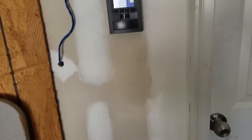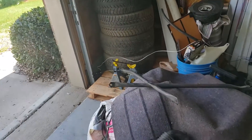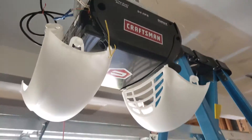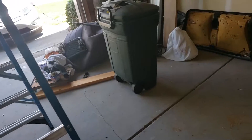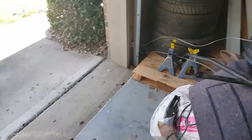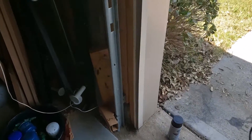So you're wondering, why would it not work today? You wonder and wonder, and then you trace your wiring back, and you actually rerun your wires, you retwist your wires, you plug them back in. You check them all — the wires have continuity, all the wires are great. And then you realize that your sender is the amber light and your receiver is green, and your house faces east.